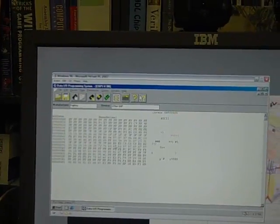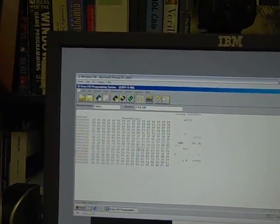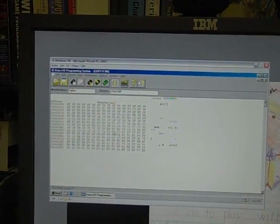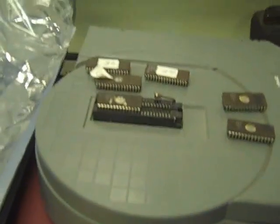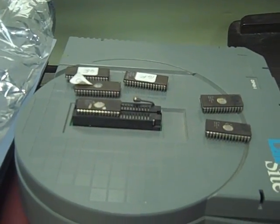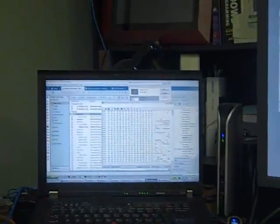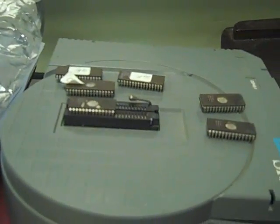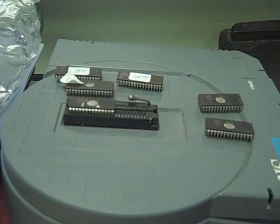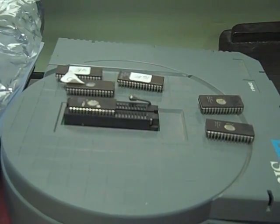It looks like what's on this board may just be a mishmash of different versions of ROMs and PROMs. But luckily these are EPROMs, so we can simply erase them and reprogram them with the proper version — which is the version in MAME. I'm going to wipe these out, load them up with the MAME version, and that should clear everything up with respect to the challenger ROMs and the graphics we're seeing.